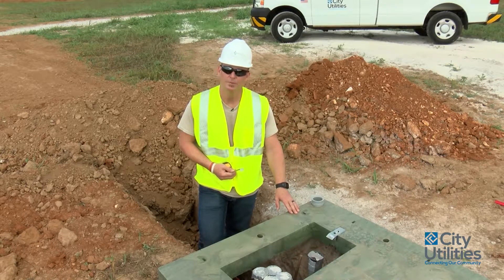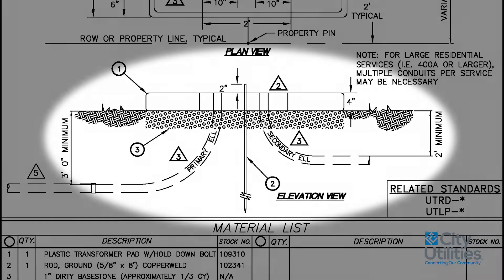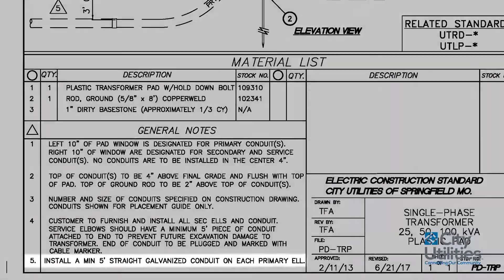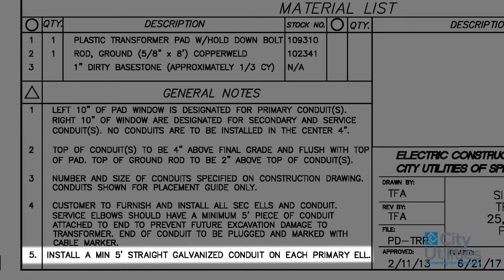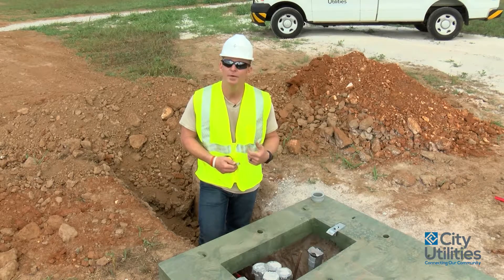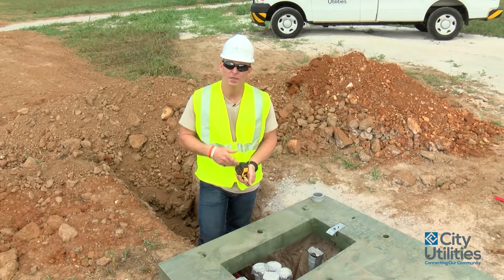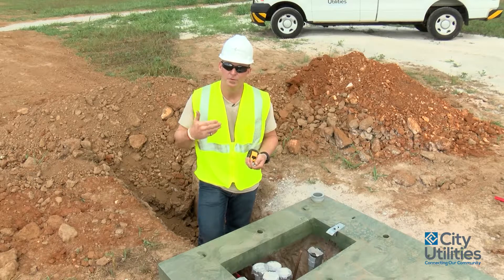On this particular location we're going to be dealing with a ground rod. We're going to be using a 36-inch radius — not a 24-inch radius, but a 36-inch radius — primary steel galvanized elbow. On the end of that elbow you'll install a five-foot section of galvanized pipe, and on the end of that you'll have what they call an FA fitting, or female adapter. It's threaded on one end to go on the galvanized and PVC on the other to accommodate the PVC pipe or conduit.